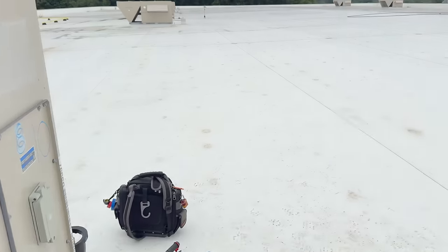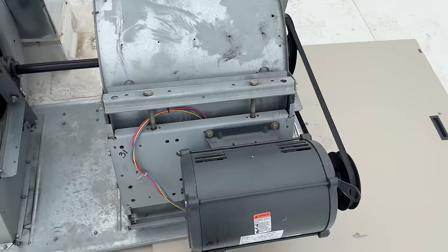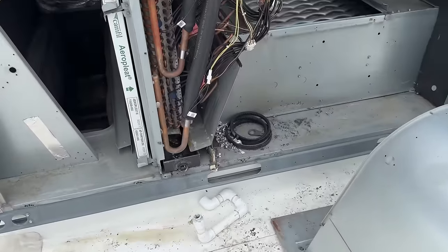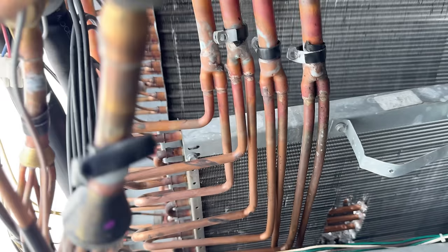You know how many compressors we've lost? Each one of these units has four compressors. We've lost at least seven or eight compressors. These belts supposedly keep loosening up. Now yeah, that's a maintenance issue, but you would think the freeze protection would work — and you can only quote so much and then people don't approve it. This is what happens.